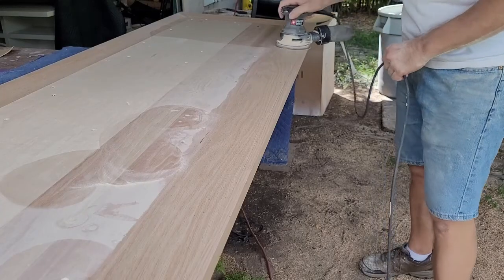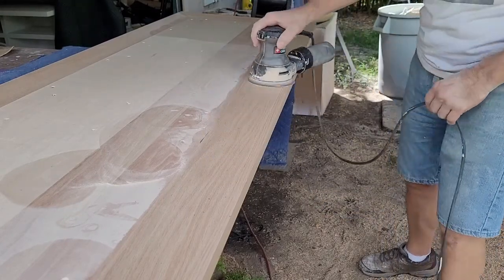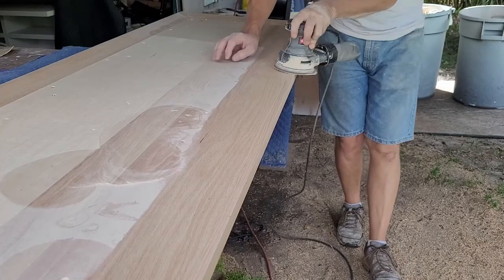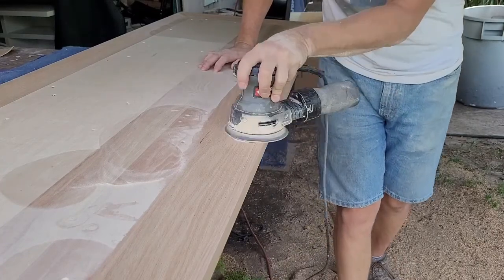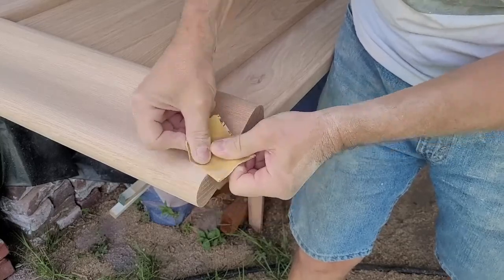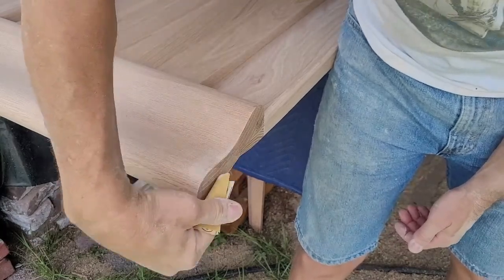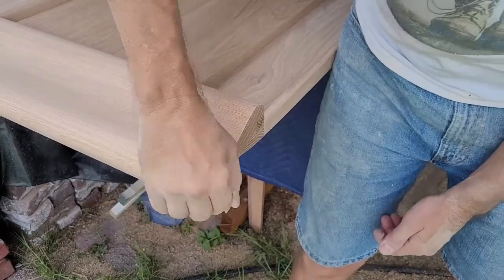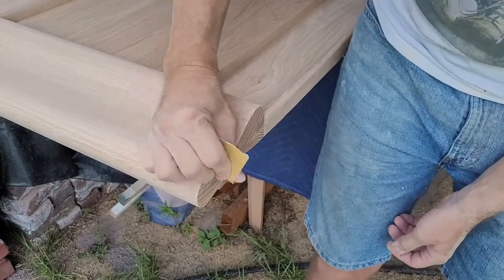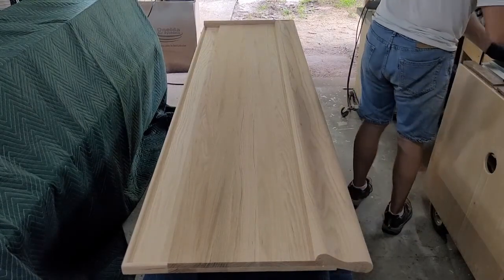With all the trim in place, the entire assembly got a good sanding starting at 120 grit up through 220 grit with my random orbit sander. I like my pieces to have sharp-looking edges, but not so sharp they'll cut you. To get this look, I used my sander with 220 grit paper and with a few passes eased all the square edges. There were also a few curved edges that needed attention by hand — I used 220 grit paper and gave them one last pass with the grain to ensure no cross-grain scratches. After blowing off all the dust and cleaning out as much of the open grain as possible, I moved the top inside for finishing.